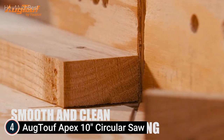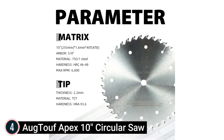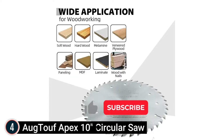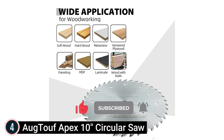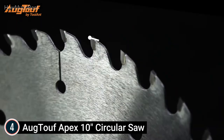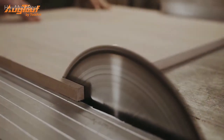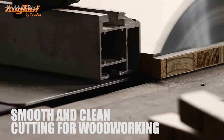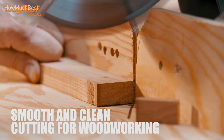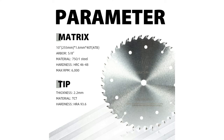Providing a high degree of surface edge finish, the ATB (Alternating Top Bevel) tooth design incorporates an alternating top bevel offset tooth layout. The angle of the tooth scores the surface of the timber in advance of the cut, cleanly severing the wood fibers before the following teeth remove the chip. This provides a much smoother cut with much less possibility of splintering the surface of the wood. Tungsten carbide teeth provide superb wear and heat resistance. The positive cutting angle offers quick and efficient elimination of chips and swarf.